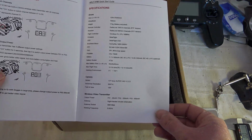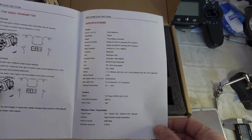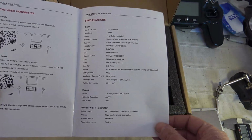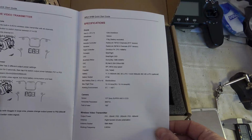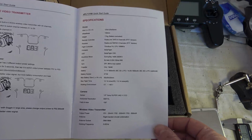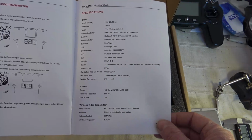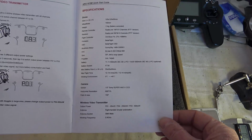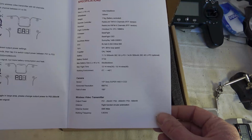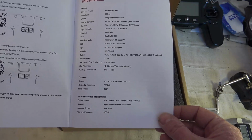So the main characteristics can be found on the last page, where we have to know that we have an F4 MCU with a built-in OSD. That's great. Motors are some SunnySky 1406 announced to spin at 3300 kV, so 4S compatible for sure. ESC, a 4-in-1 ESC board with a nominal 20 ampere running, okay, and with a peak at 30. Of course, supporting the DShot600 protocol. The gyros are connected via SPI, so 8 kHz compatible.